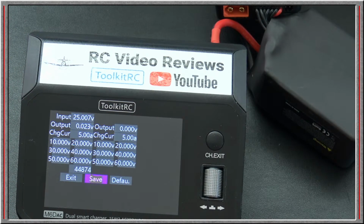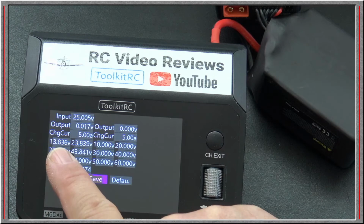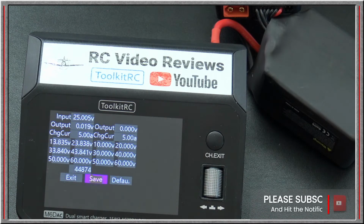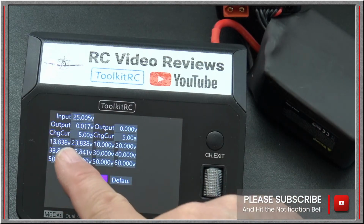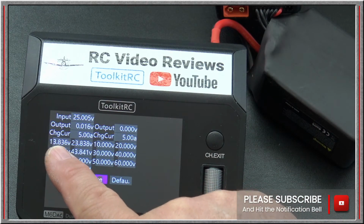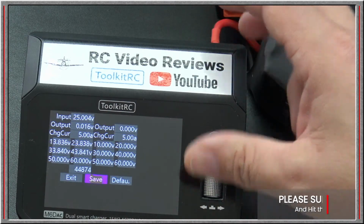So if I take a 4S battery and plug it in right here, you can see now that I've got a 4S battery plugged in, and you can see the voltages. So all you have to do is know what your values are on this. And I've shown how to do this before, so I'm not going to cover it today, but go in these fields, make adjustments to this calibration value. And then when you're all done, you just hit save. And that's it. It's calibrated.